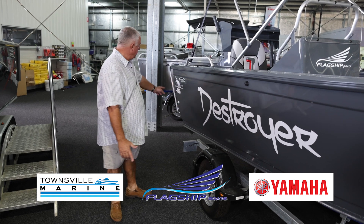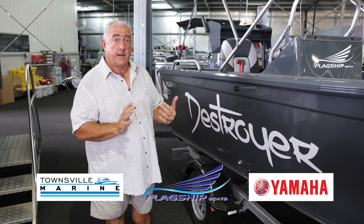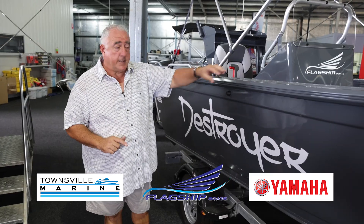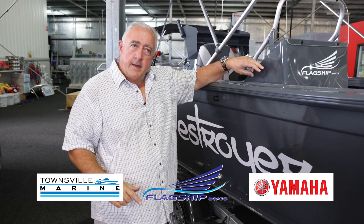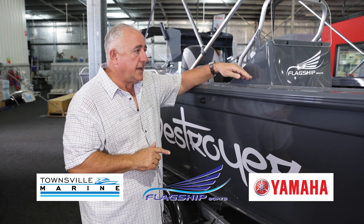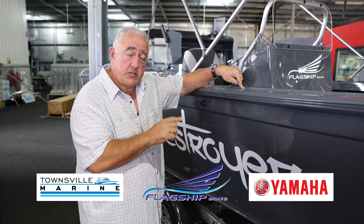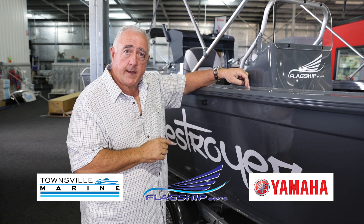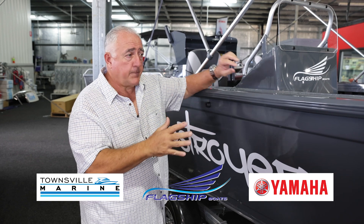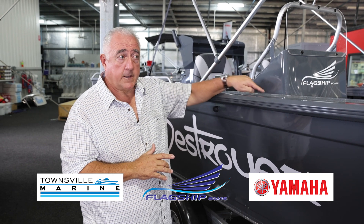Our Destroyers are our flagship — I call them that because we ask the manufacturer to customize them to suit us. You'll see they have fully welded side decks, not stitch welding. People ask: why fully welded? Well, it's cheaper not to do it, but when you put a boat in salt water with a little sand and vibration, the paint starts to etch away and before you know it, you've got paint bubbling and peeling. It's less likely to happen if the boat is fully welded.